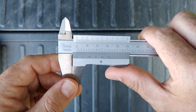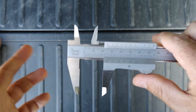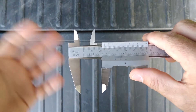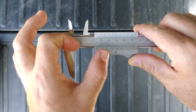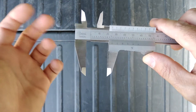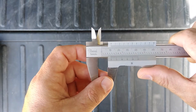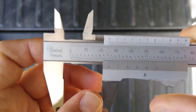For starters, let's look at one inch. You're probably familiar with the normal divisions of inches — halves, quarters, eighths, sixteenths, thirty-seconds, sixty-fourths, etc., dividing by half. That is not the divisions we use here. To get that type of precision in aviation, machining, and industry, we divide the inch into ten equal parts.